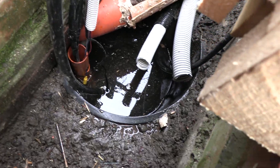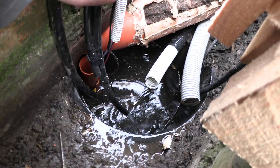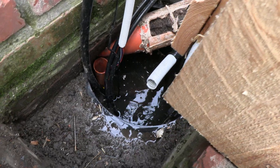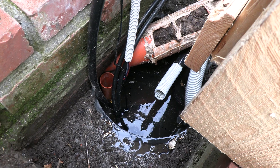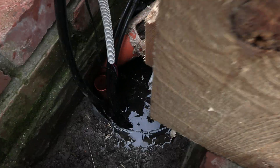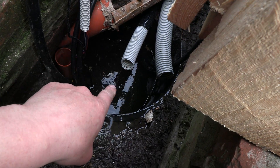So this is the other end - this pipe is currently emptying into the collection tank. The collection tank has to be below ground, because obviously gravity needs to take the water here. I wouldn't be able to make the water go up into the big 1000 litre IBC. All the water from all the sources flows into here.